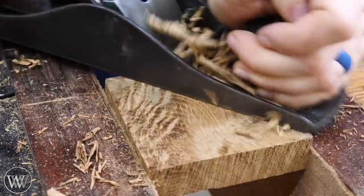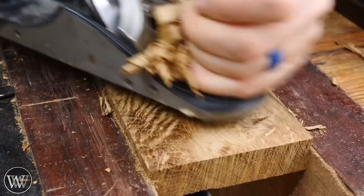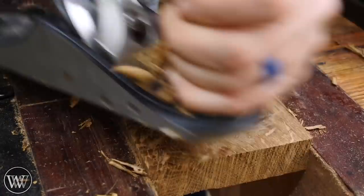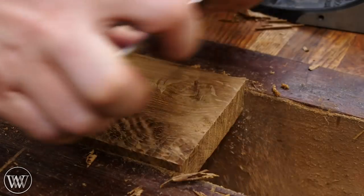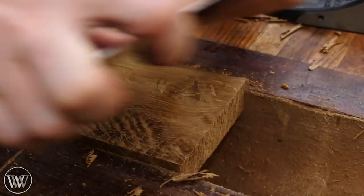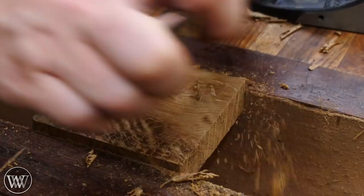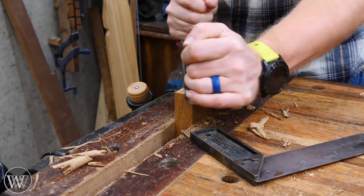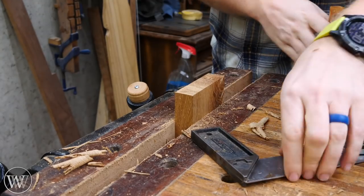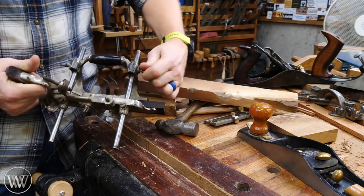With the figured wood it took a little bit more time than I was wanting, but the chatoyance on this was just absolutely gorgeous and made everything happy. So I was using a rough plane, bringing it down to a smoothing plane, making sure everything is really nice, and then finishing it off with the card scraper — that just brings everything into that finished appearance. Now that we have these roughed out, we can then clean up the two other sides that weren't originally smoothed out: the outside edge and end.